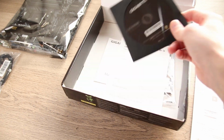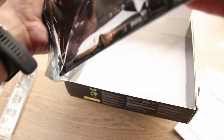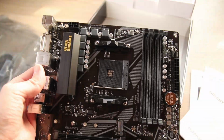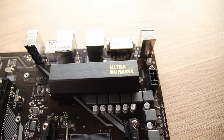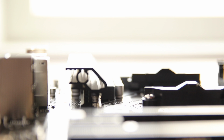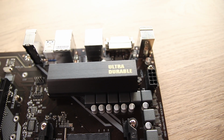So this is a sub 100 USD motherboard, and for that price you do have to make some compromises, but let's take a look at what features this board has. It has what Gigabyte calls a 5+3-phase VRM, which is plenty good enough for a 6-core and probably an 8-core. The heatsink is small, but it does have a bit of surface area, which should aid heat dissipation. It appears to also be made for use with a heat pipe, although this board has no heat pipes, so yeah, it's probably leftover parts.